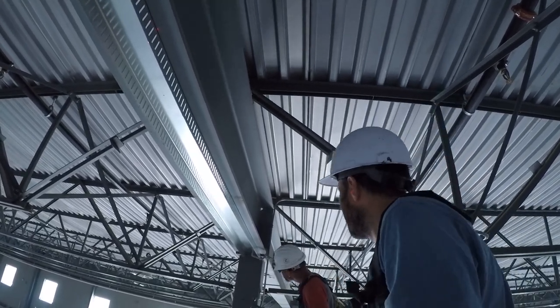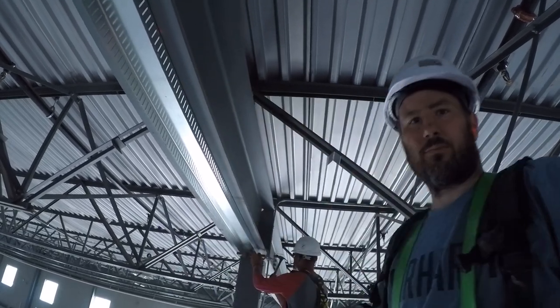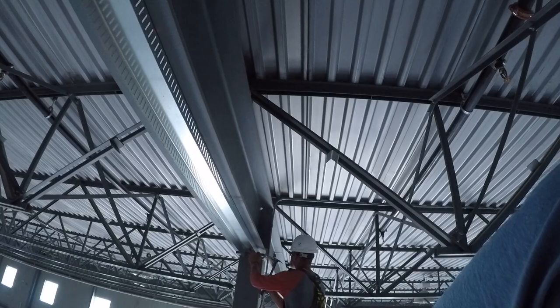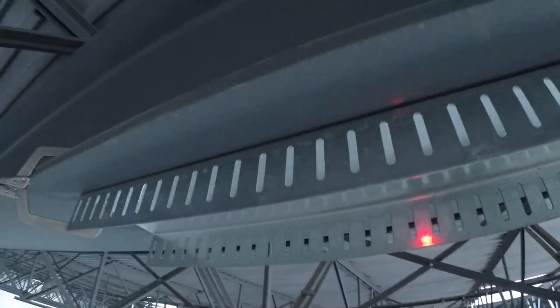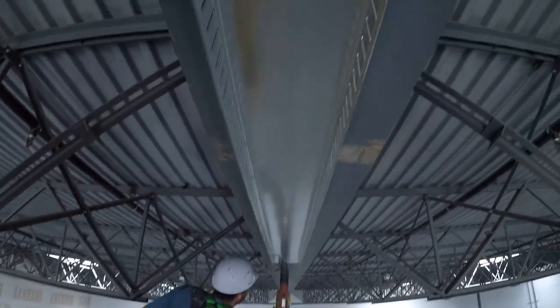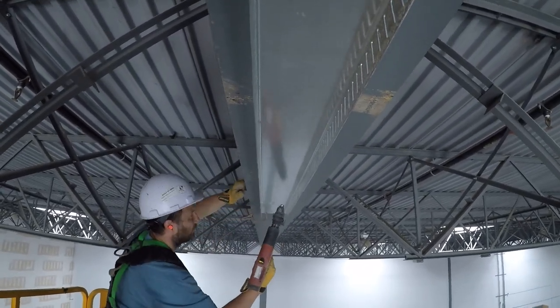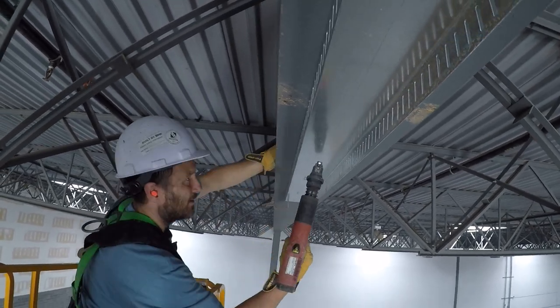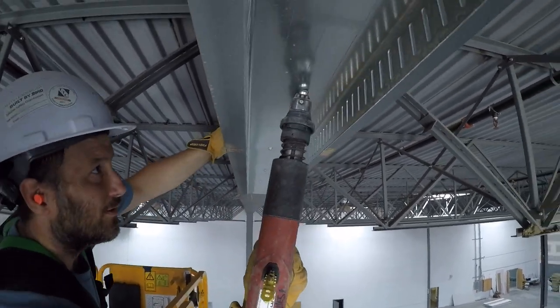Just split the beam all the time. If you want, once it's clamped in, you can use a hammer to bang it into level and into the laser line. You can see how far in the track is — it's crazy. If any of you guys have ever built a 14-gauge steel stud wall, let me know in the comments. You always shoot one in the ends and then go every foot. I'm going into more detail on how I installed the top track in this video because you guys have been asking a lot about it.